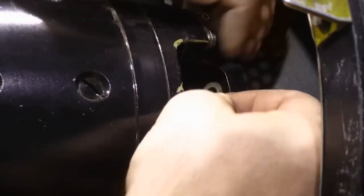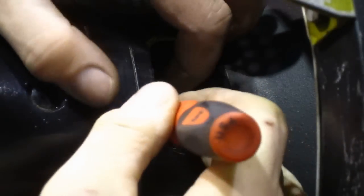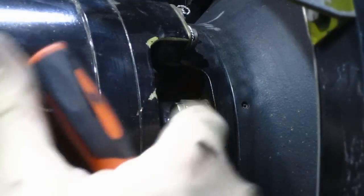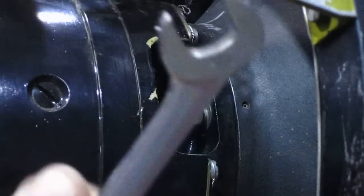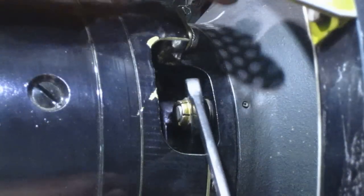The starter is held on by six studs and nuts. A little tricky to get it started — everything's tight, very little clearance. These studs actually don't just attach the starter; they are what the torque works against to drive the spline. There is no locking mechanism — it's simply these six studs, nicely tightened, that anchor the starter body, and then the torque of the main shaft of the starter turns over the engine.